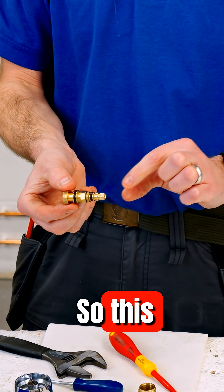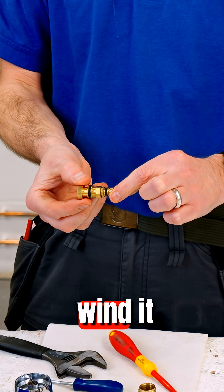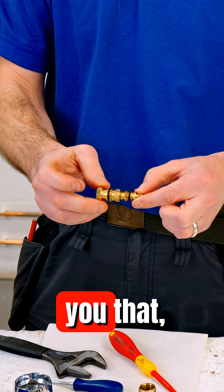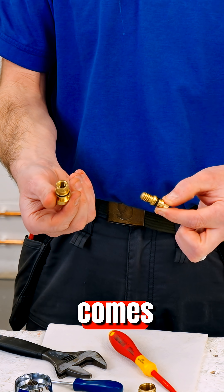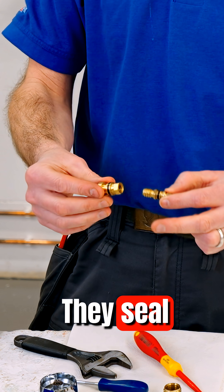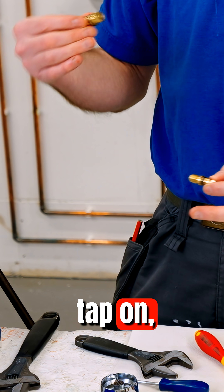...is the inside of a tap. This is the bit the tap head goes onto. When I wind it that way, that opens it — that's as far as it can go. But there's a thread on that. If I show you, I wind it right down and that comes off. I've got an o-ring up here and an o-ring up there — they seal the water in, so when I turn the tap on, although the water comes out the spout, it doesn't come up through the gland.